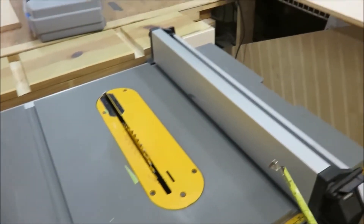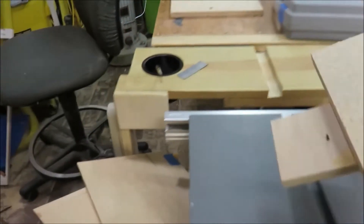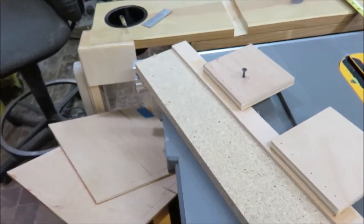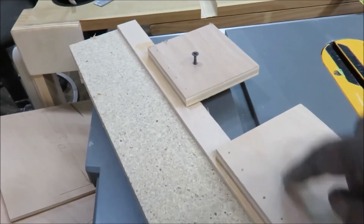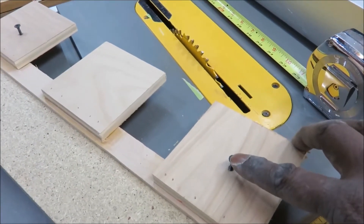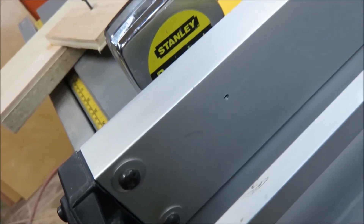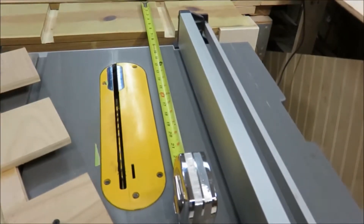What I did was I modified this with an extension rip fence side. The way this works is basically three-quarter inch MDF glued to a quarter inch to one inch piece of plywood, and then a half inch plywood, fastened by two fine-threaded drywall screws. I end up drilling two holes on the side on the opposite side of my rip fence. Let me put the camera down for a second to show you how this looks once it's assembled.